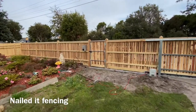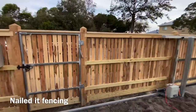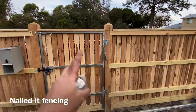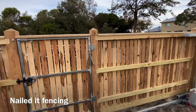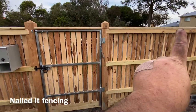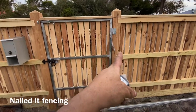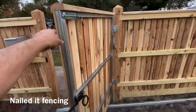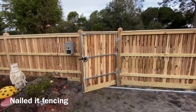On the pedestrian gate here we've just added a self-close. As you can see, the sliding gate comes past the pedestrian gate, so in order to not have the sliding gate slam into the pedestrian gate, what we've done is we've made sure we're hinged on this side — so if the gate was to slide, it would knock this gate closed. But we've also added a spring-load here.